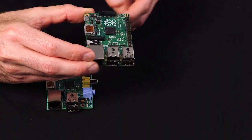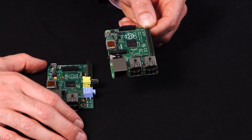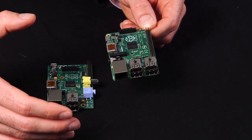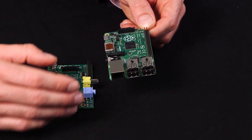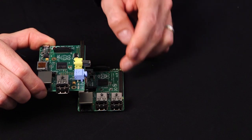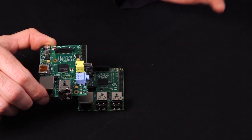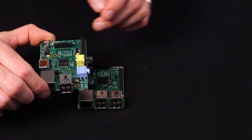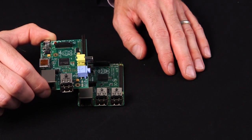Another area that has been expanded on the Model B Plus is there's a 40-pin GPIO header now. This allows you to interact more with the world around you and connect even bigger, more fully-featured add-on cards as they become available. The nice thing is the care was taken on the first 26 pins to maintain full 100% backwards compatibility with your existing Pi. Those first 26 pins don't change — they've just added 14 more pins.